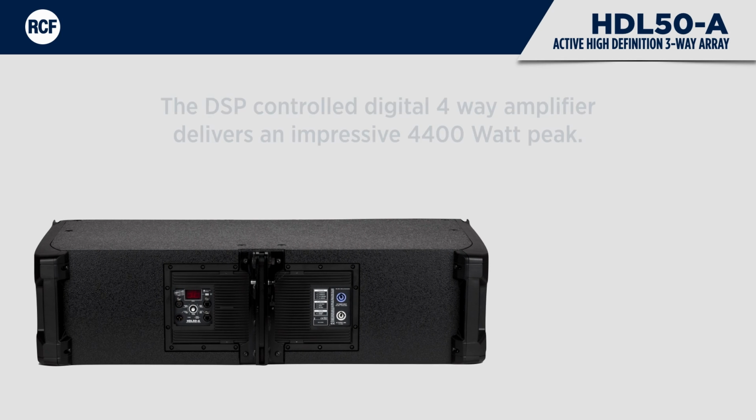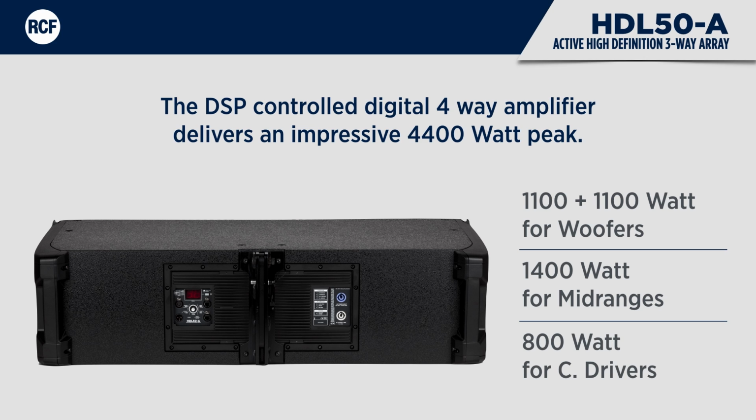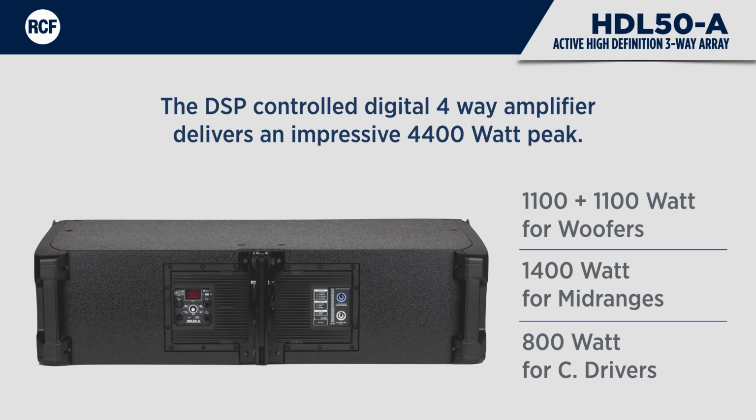The DSP-controlled digital 4-way amplifier delivers an impressive 4,400 watts peak. The power is managed as follows: 1100 plus 1100 watt for the woofers, 1400 watt for the 4 mid-ranges, and 800 watt power to the compression drivers.